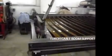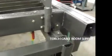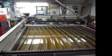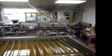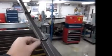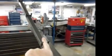The next refinement added was a bolt-on plate and this boom, which swivels. This is the cable holder for the torch — it supports the cable and allows it to move unencumbered when we run the machine in the X and Y axis. The little supports for the cable were all cut on the machine and tack welded on, so the cable just sits in here with no need to fasten it. Gravity just holds it in place.